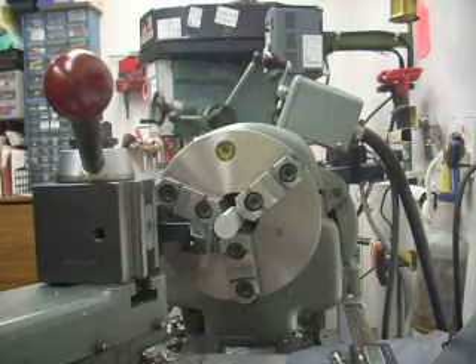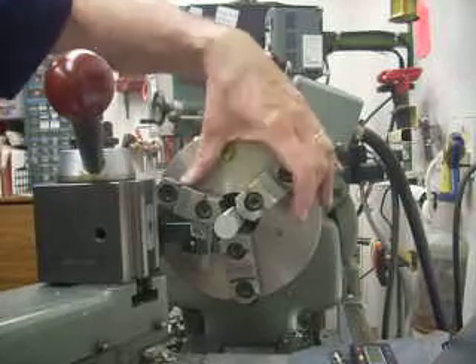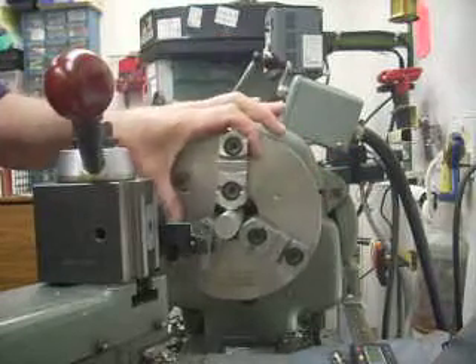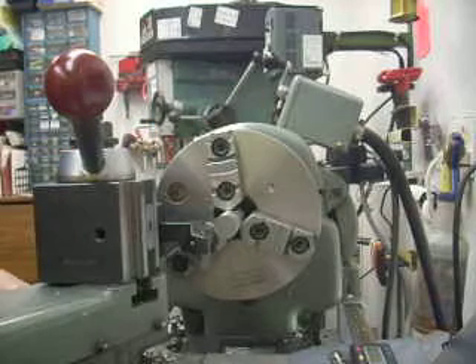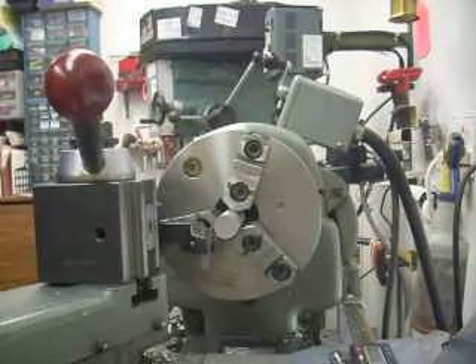These are Timken bearings, and on my machine I get plenty of resistance — on the order of 40 ohms, in fact. Sometimes I have to rotate the spindle by hand just a few degrees in order to move the oil around, because that's what I'm depending on for insulation. So after you connect it up, you may have to bump it. I recommend you get access to an ohmmeter that can measure down into the less than five ohm range, just to be sure that it's worth your time to make one of these.